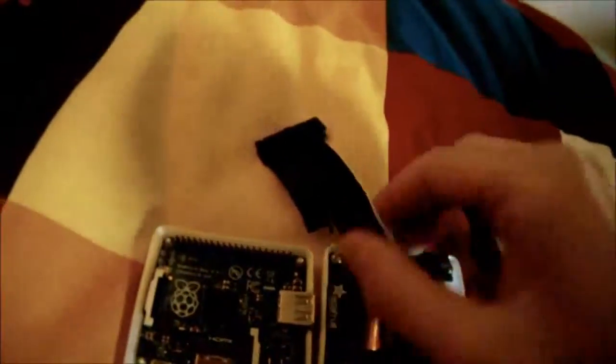So the idea is the software is set to GPIO pins, like pin 4 for the A button, pin 5 for the B button, things like that. And you would solder these things onto the back of this perf board here. So when I did this originally, I inserted it over here, and I soldered them on. But when I tried the unit after, the controls weren't working at all. So I took this off, but it's busted anyway.